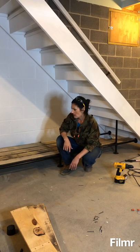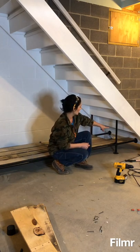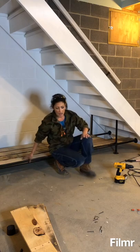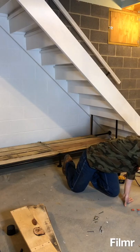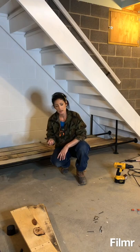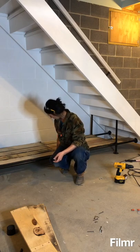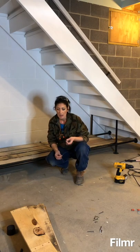So far so good. I am going to anchor it and attach it where I can. There's a small section down there. I anchored that. I'm going to anchor these. The next part of this is just going to be like a time-lapse video. Some helpful hints. I used these conduit or pipe brackets underneath. You can do that, but as I realized, it is not absolutely necessary. If you just want to drill a pilot hole and take a screw straight through the wood down into the PVC, that seems to be holding just as well.